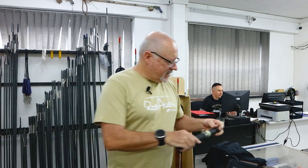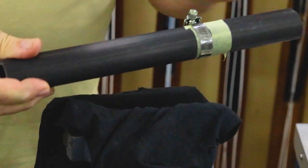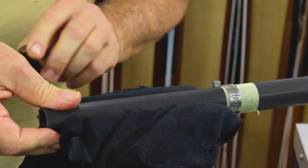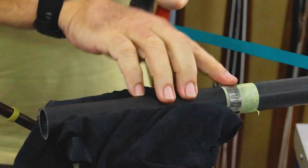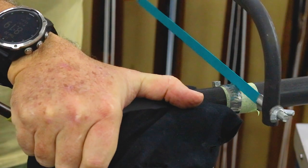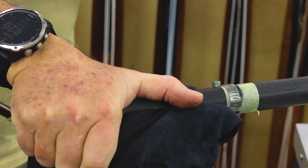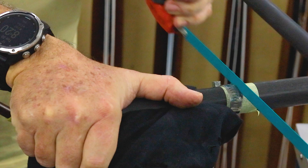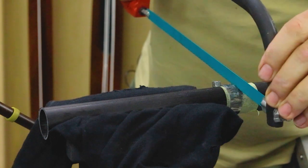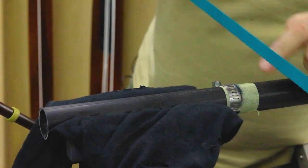Let's see how well this goes. Obviously we can't cut where the screw section is, so let me rotate that a little. There's my mark. This is a new blade so it cuts very well — don't push too hard, just through the wall. Now I'm going to slowly rotate forward, keeping the blade against the stainless steel band, trying to cut ahead the whole time and not at the back.